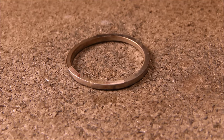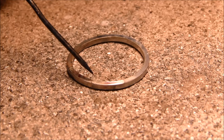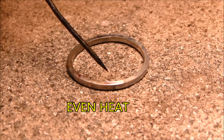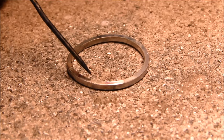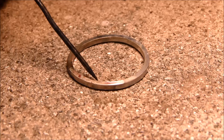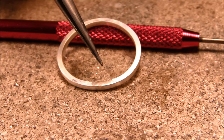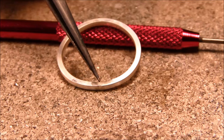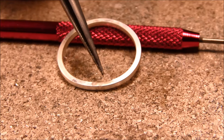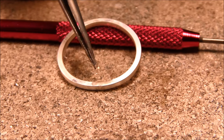And there we go. We have a nice smooth solder joint right here where the solder melted down in between the two because we had even heat on both sides. That's the fifth secret — heat evenly so it doesn't run to one side or the other, and it flowed right into the solder joint. So we have a perfect solder joint. A little bit of solder left to be cleaned up — we can file that down, use emery cloth and then steel wool, and it will blend right in and you'll never see that seam at all.